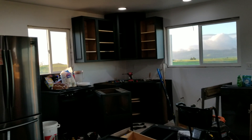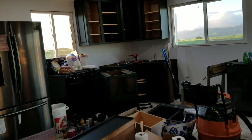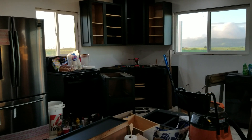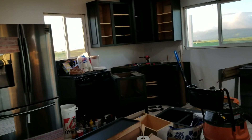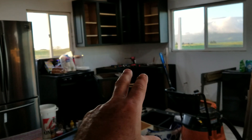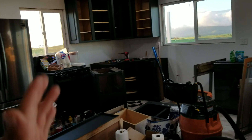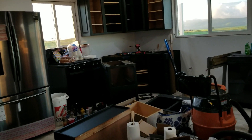That way when I spray, all my cabinets will match — which is what I should have done from the beginning. I was hoping one gallon would be enough, but because I'm putting like four coats on each one to make a nice finish, I'm eating through quite a bit of paint. The first cabinet I did required a lot of extra thinning and testing, which used up a lot. Some people may say it's not a big deal and would leave it, but I cannot live with seeing two different tones — one darker, one lighter — the color scheme just isn't the same.